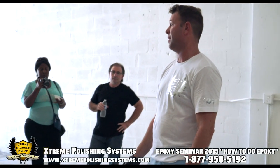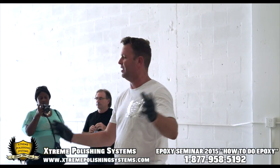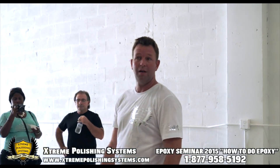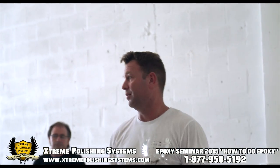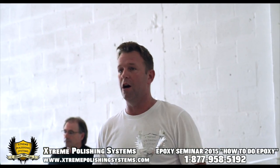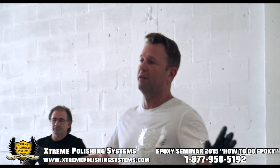Mixing is the biggest problem. You make one bad mix on a job, forget it. It's ruined. There's nothing you can do. You gotta xylene, clean it. It's a nightmare. Did everybody just understand that? If you make one bad mix, so say you're doing a job like this. You start here, you come down squeegeeing, you're working. All of a sudden, the mix right here is bad. But then the next three mixes are good. Doesn't matter. The whole floor is ruined.